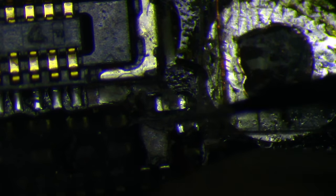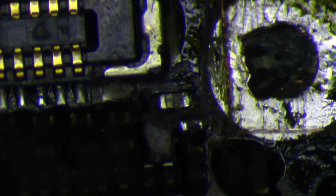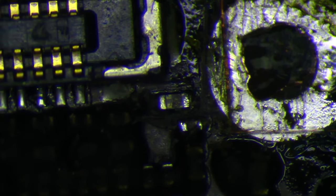This is the backlight anode and it looks like that may be the problem — it got a little bit hot. Usually the underfill doesn't pick away this easily, and I can kind of see that doesn't look like a factory joint there. There's something off about it, it's kind of discolored a little bit. How great would it be if this was just the backlight filter and I don't have to rebuild the entire backlight circuit? It would be very awesome — super awesome.